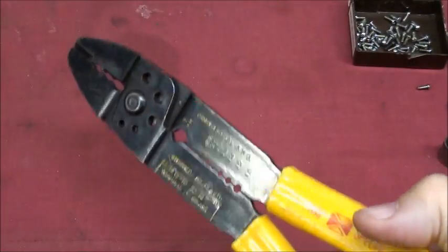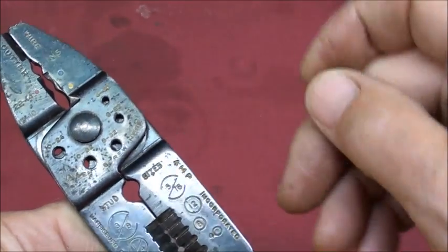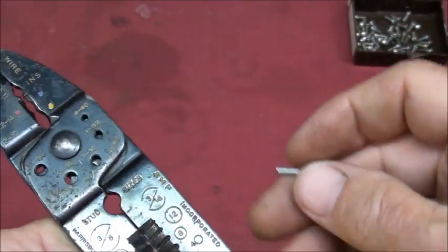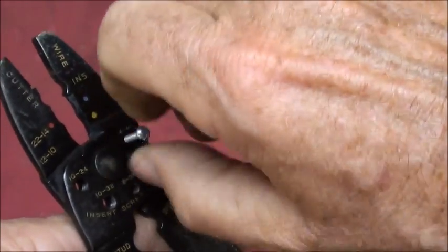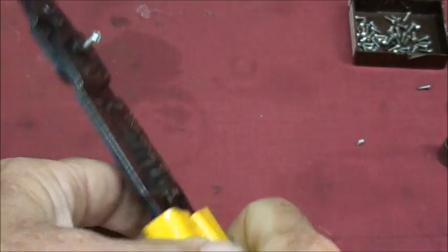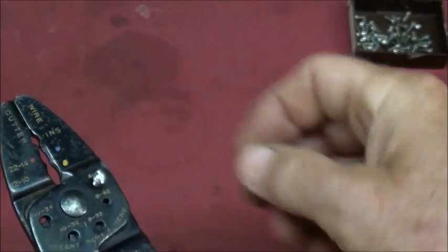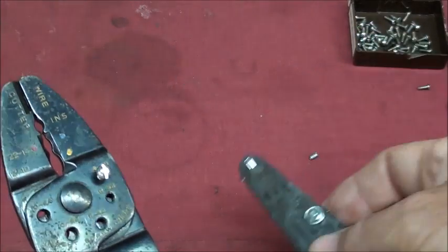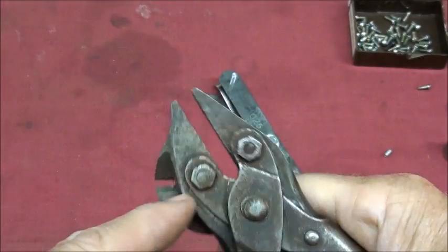Most of you probably have one of these wire strippers. This one is made in America - don't get the Japanese or Chinese ones. Often we have to cut off a little screw. This is a 4-40, but this goes up to 10-24. When you put them into the correct threaded hole here, you can measure how long you want it and simply cut it off. Make sure you thread it in from this side, because as you back it out with the screwdriver, that will clean the thread up. However, it will be sheared on the end, so then you might want to put it in the holders and grind it smooth. I like that method of cutting off threaded rod or small screws. If you just cut them off with a shear, it buggers up the thread.